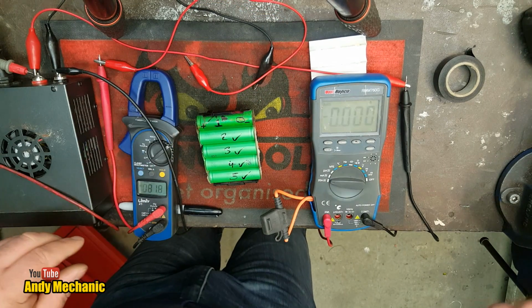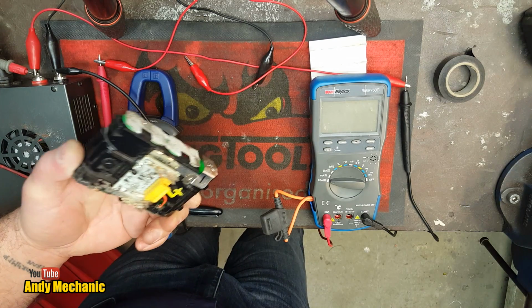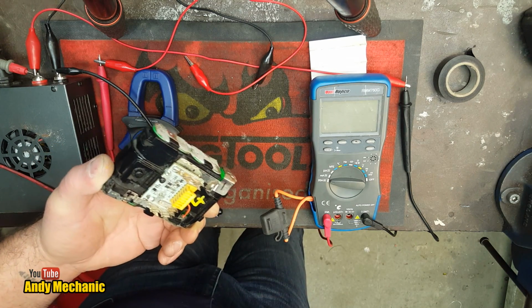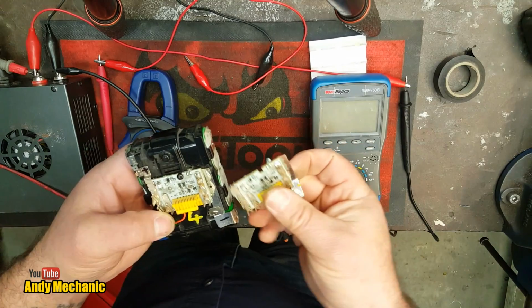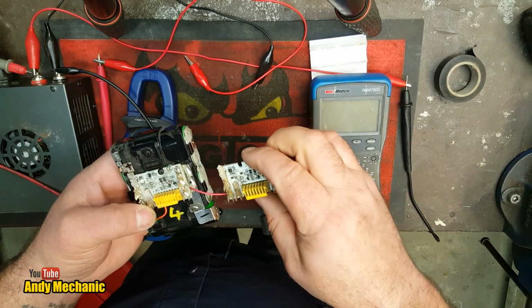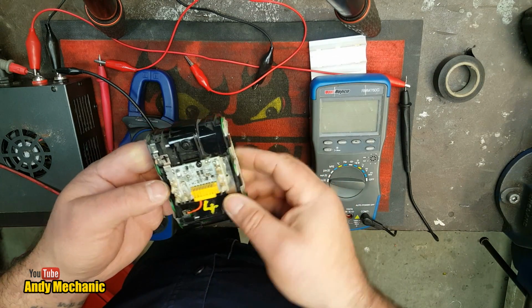And we'll go back to the side of the bench, and we'll fit this into its old casing and try it on the charger. If that doesn't work, it needs a new board. And I'm going to buy some more boards with the screw in the right place, because that one is the same as that one there, look, which is different to that one. I bet you learn stuff doing this, don't you? You realise that they've made them different.